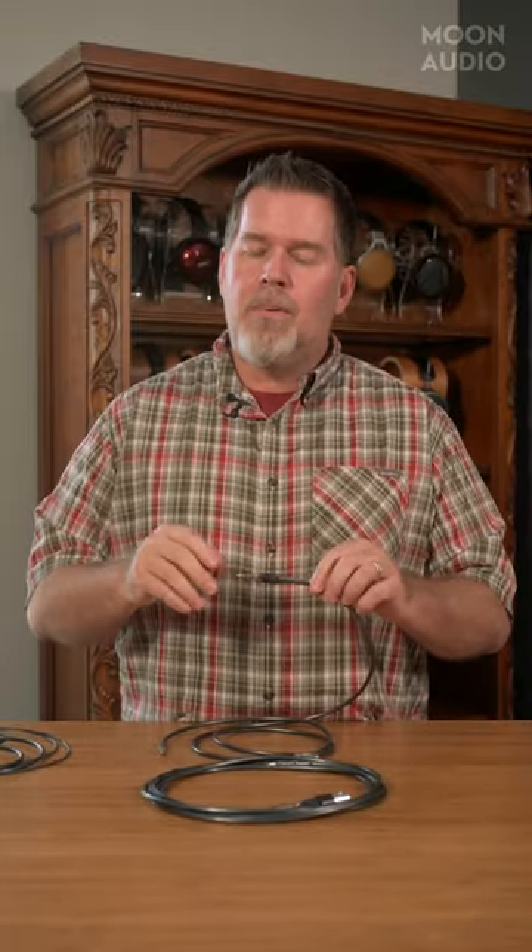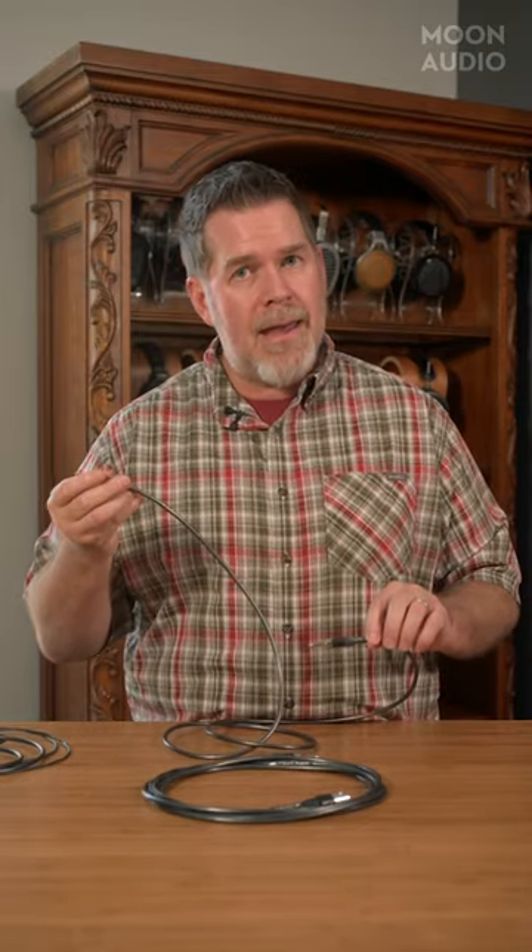To recap: poles make a huge difference in terms of grounding scheme with electronics — not so much with headphones, but with electronics it's very important. You can't go from a single-ended connection to a balanced connection without causing a problem of shorting the balanced amplifier circuit or input circuit. It all comes down to the way the circuit is designed. There are a few electronic companies using balanced connectors but in a single-ended format only. Are you confused? So am I — and so is everybody else.